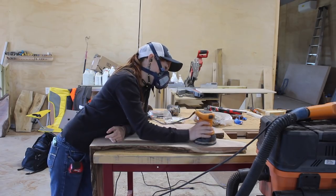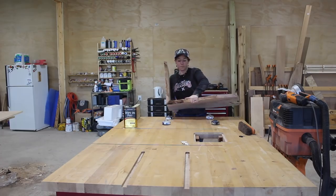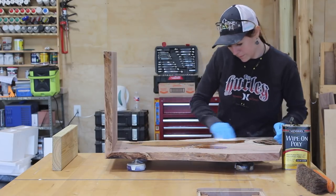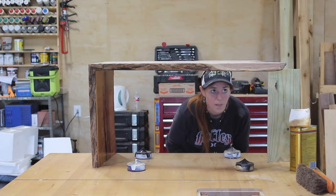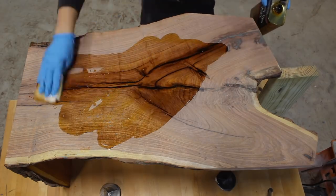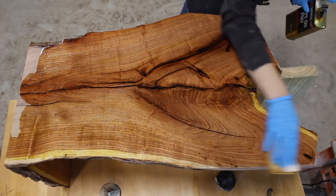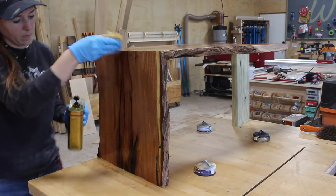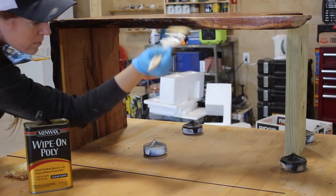I went ahead and sanded the entire piece to finish - starting with 80 grit to remove the plywood residue, then 120, then 220. After cleaning off all the fine dust I started setting up to finish the table. I got four bench cookies out and started off finishing the inside of the table first, then flipped it using a 2x6 to prop it up and repeated for the top surface. I'm using Minwax wipe-on poly - I love this finish as I find it the easiest to not mess up. It's very good at self-leveling, doesn't leave a high-glossy plastic look, is quick to dry but also very durable. I pour it directly on the workpiece and spread it with paper towels, using a brush on the bark to get into all the nooks and crannies.